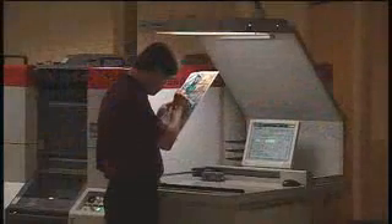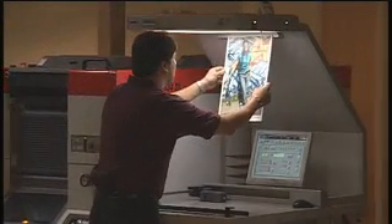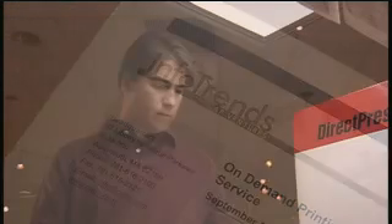This kind of changeover means high productivity and profit. What you've just seen is a digital offset press running a job, printed in precise registration automatically — using a 300-line screen. If these jobs were printed on a conventional press, just the cost to set up the press would not justify jobs at these run lengths; the make-ready alone would take longer than it takes to run the entire job. If just one of these jobs were run on copier-based technology, the cost per page would have been four times the cost of running it on the DI press, according to InfoTrends, Inc. print-on-demand market study.